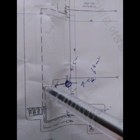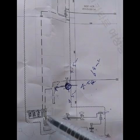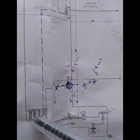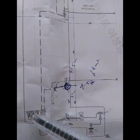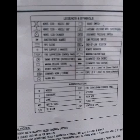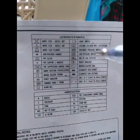If you see dot-dot routing on the drawing, that means 1.5 mm fire rated wire. If there is no dot-dot, that means 2.5 mm fire rated wire. For these three symbols — DPS, LPS, and LS cable — you can check their meanings in the legends and symbols column in the corner of the drawing.